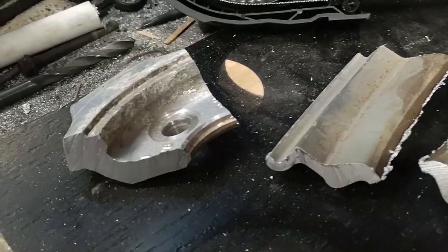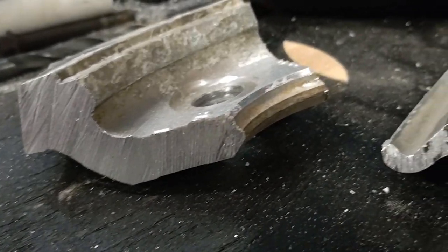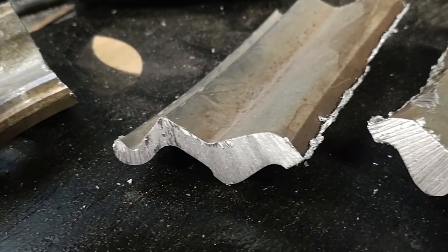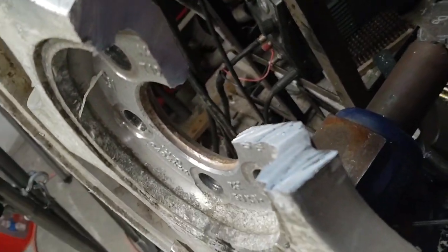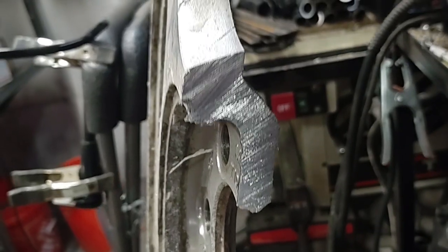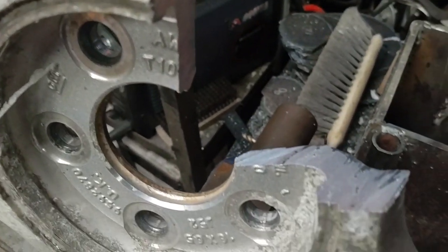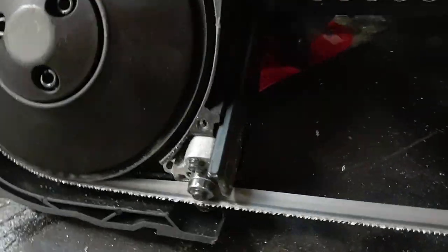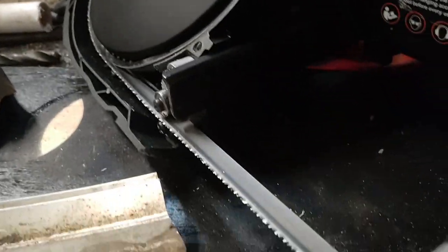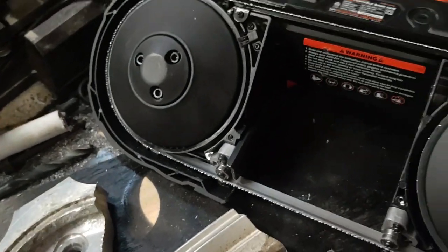Here are the results from the first test. Even going through three-quarter inch aluminum you still get a pretty clean cut. This is my first time using a portable bandsaw, so it's kind of a learning curve, but it does kick back a lot more than I was expecting. If you try to back the blade out of a cut it might just pull the blade off, like you saw on the first cut. Also, using the blade guide helps quite a bit, so hold your work piece against the guide and it'll stop the saw from kicking back on you.